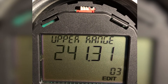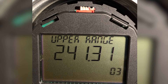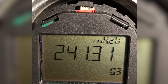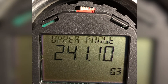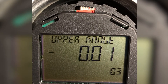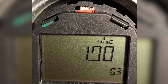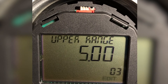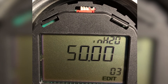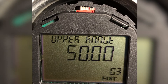I now go to the upper range value that will equal 20 milliamps, in parameter 3. Once again I hit the edit button — the right-hand button — and it says 240, which is the top end of this capsule. So I want to decrease that, and I want 50 for that. I went to zero and now I'm going to come up to 50 using the left center button. There's 50, I enter that. So I have my zero to 50 inches of input pressure that my orifice plate is going to generate.